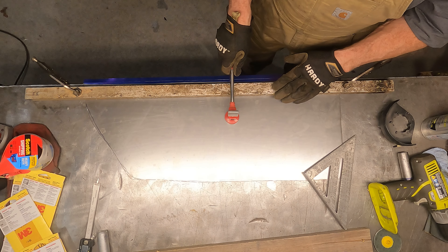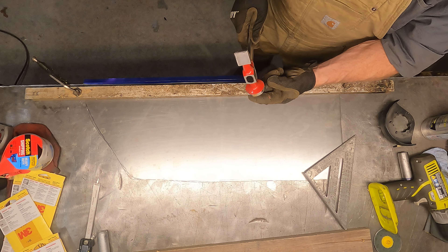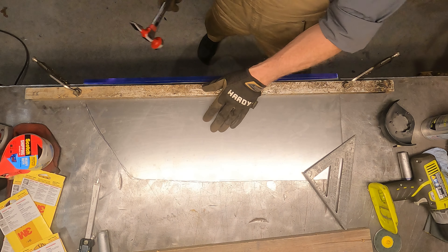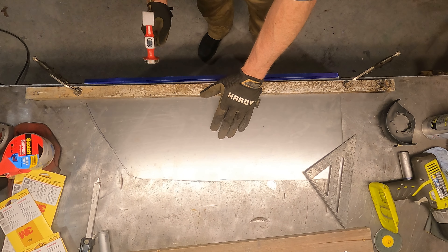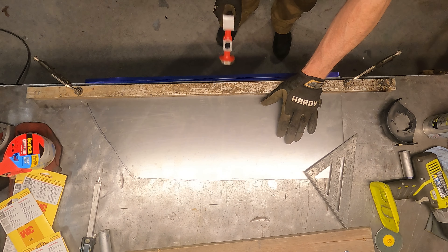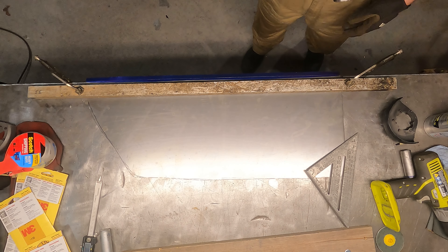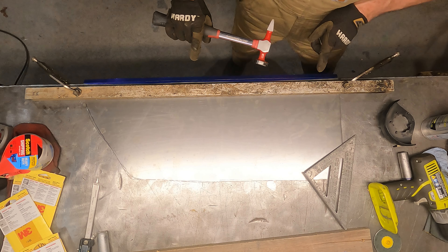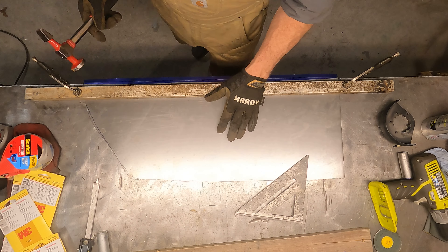The metal starts out flat, and as the metal rolls, I'm keeping the hammer flat to the metal I want to move. I'm not continuing to angle it because then we'd be using just the edge of the hammer and that would leave little circular gouges. So we want to hit the metal flat, kind of in a glancing blow downhill. As it starts to roll over, our blow is going to get more perpendicular to the metal, so we want to be sure we're not driving this sheet forward. Every now and then, take your angle and check if your scribe line is still lining up — that way you know you haven't slid the bottom sheet forward.